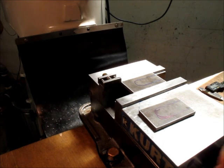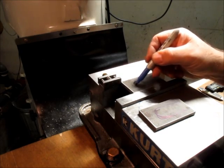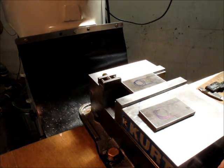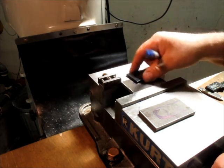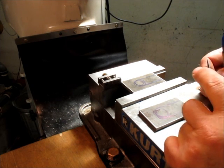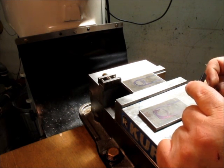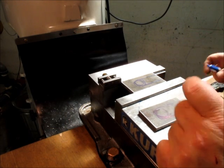All right. So the first thing is we're going to smack a hole right here in both of these. Then we'll mill an angle on this wedge, and then the last operation will be to cut these sides. These aren't really too fussy here, so I'll probably just bandsaw those instead of milling them. That way, I don't have this horseshoe situation.